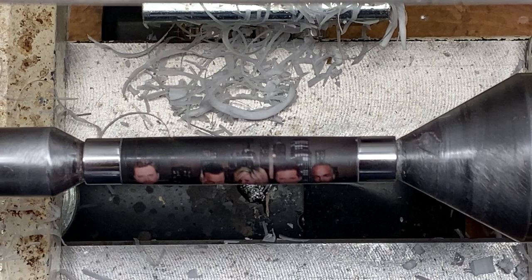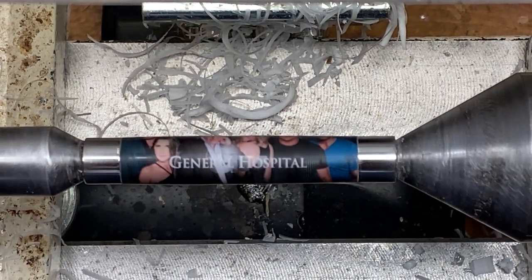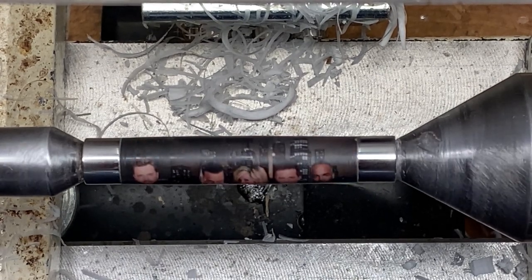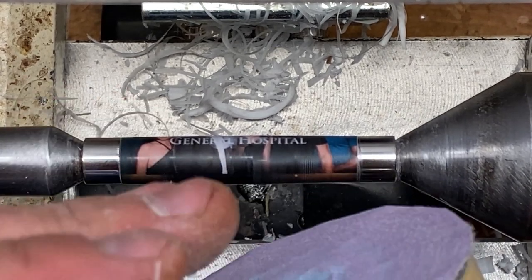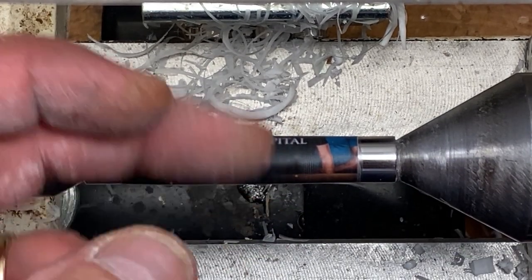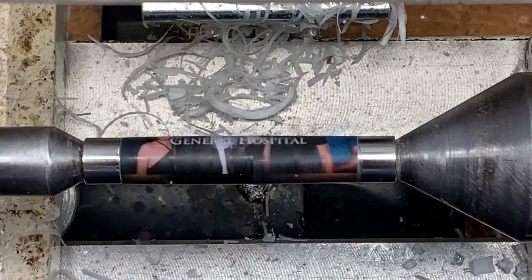I've got the blank turned down to the bushings and I'm ready to begin sanding. For sanding I'm going to use my foam-backed hook and loop sandpaper. You've got to be careful using this because it takes away a lot of material quickly, so you have to have a light touch and be very cognizant of what you're doing because you can mess a blank up really quick. The thing I like about the hook and loop and the orbital motion of the drill is it doesn't produce circular scratches in the blank — because it's moving as the blank is moving, I get a nice even surface.